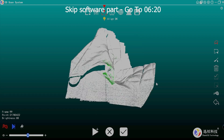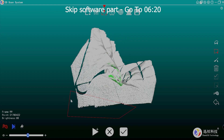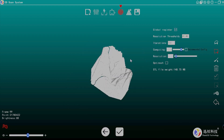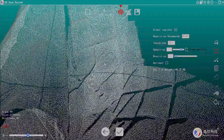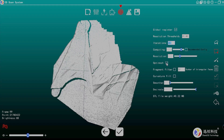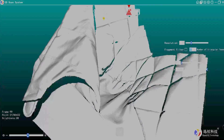To show the process I'll scan a different object. The next step lets you remove unwanted data — for example, removing an area you don't need. Then we move to meshing settings where you can see all the points. Let's go with 0.5 millimeter resolution — we don't need much more in the mesh. It will then process and you get an STL file, and that's the mesh done.